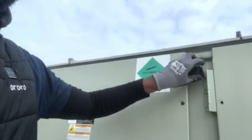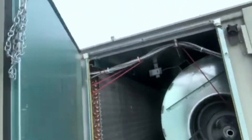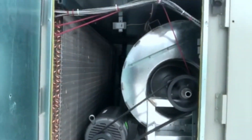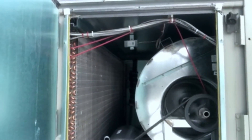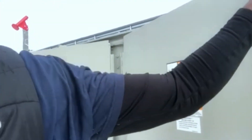I also want to open up my fan section and inspect the tension of my supply fan belt — of course, you inspect that when it's not running. I also want to go ahead and grease my bearings for the shaft fan shaft as well.